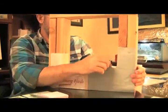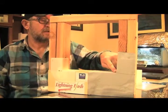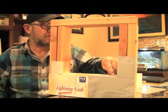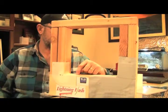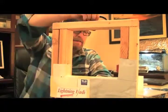First, why flashing corners are important. I'm going to show you a little mock-up here. We're concerned about this fish mouth — if you only have membrane and no strength in this corner, as a heavy window goes to sit on this, we're worried about this area right here. Additionally, as the windows move side to side to plumb up, square up, and set your reveals, we're worried that the heavy window can damage that bituthane or your peel-and-stick membrane. With a flashing corner in place, we protect this area that's very vulnerable. This is a very strong piece of material that will protect against fish mouths and protect against the abrasion that could happen when the windows move side to side.